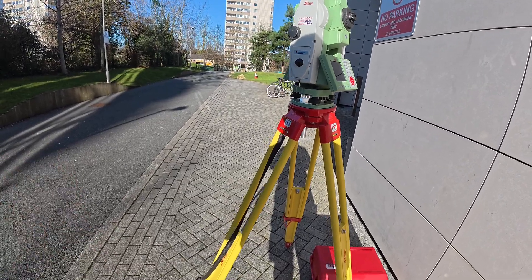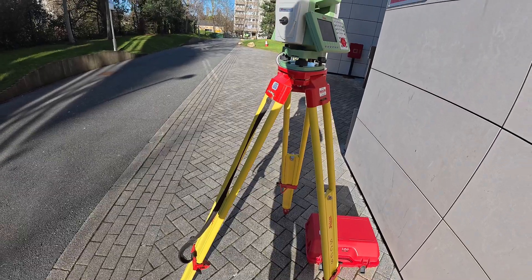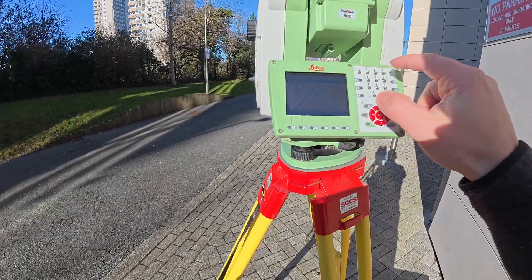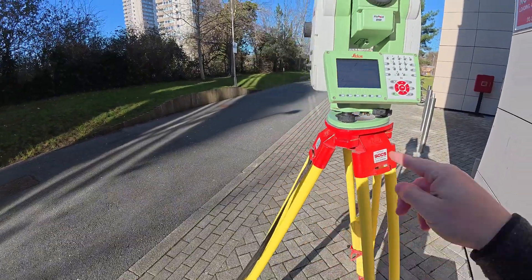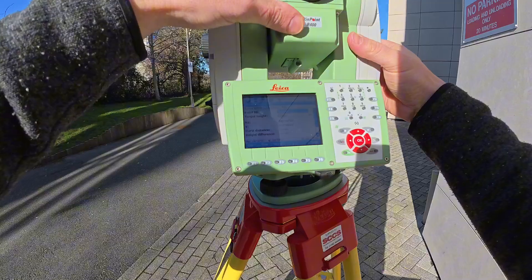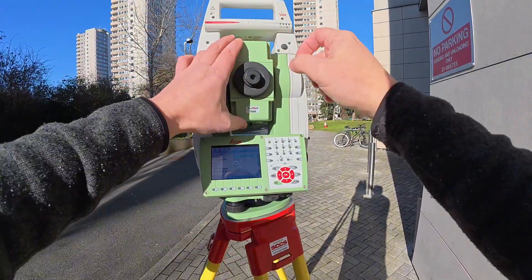We just need to make sure we're going to be measuring it at the center of it, and we're going to check two angles at the same time. I'm just going to go to survey mode. I'll be taking these angles from the instrument and then comparing them by checking two faces. As always, I'm going through the field view here on top — you can see the white cross. I'll try to show you this now.